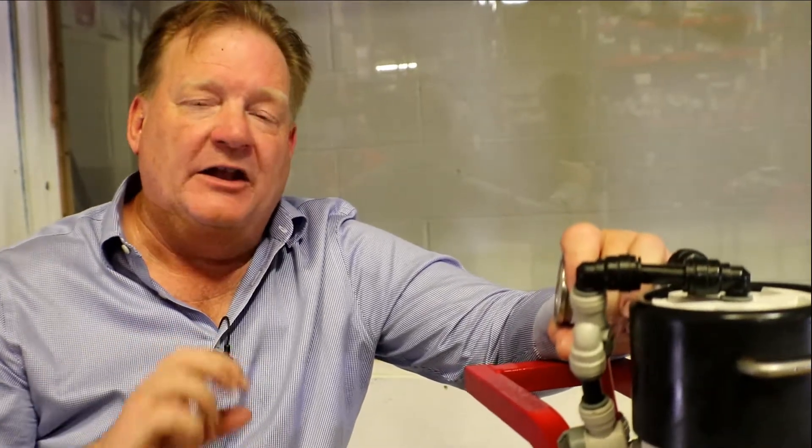Starting around $125 and going up from there, the most popular one is an impeller pump — not a positive displacement pump — because with a positive displacement pump, all the water it pumps has to go somewhere. With an impeller pump, it just creates pressure and the H2 Pro will use what it needs to get the job done. A $125 booster pump will produce an extra 40 PSI, so even if you're as low as 35 PSI coming off well water, you can boost that water up to 75 or 80 quite easily.